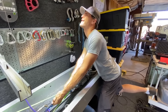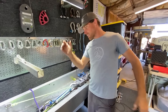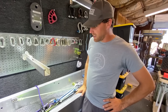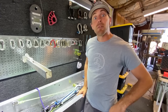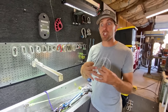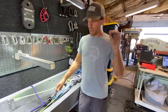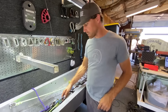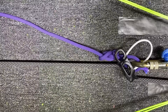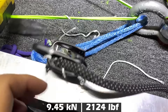Let's see if I can actually hang on more with this one. 2.44 kilonewtons. You want to see if you can get three with two hands? Two hands — I won't let you slip, Bobby. Getting heavy — no higher. I tried really hard the first time, that's why. That's more interesting to me than the rear of these things breaking at 12-ish. In a slow pull, you can't hold more than two kilonewtons. How many tests are going to be different when we get our drop tower and actually shock load things, where the peak force is for such a short period of time?